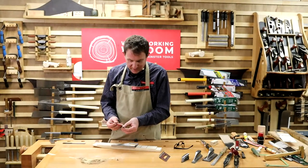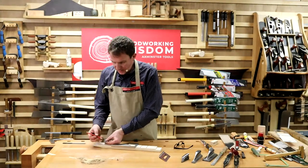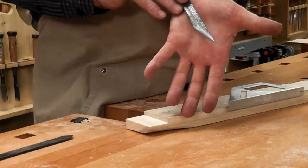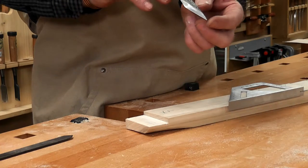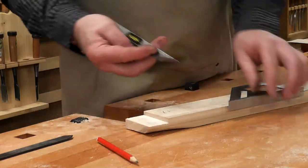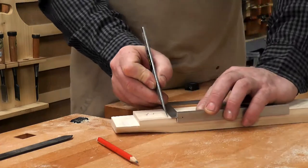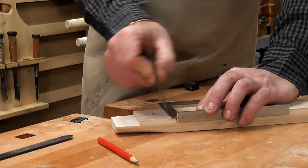This is good. Okay. They have a single bevel, which is obviously about giving it structural strength. So it comes up right to a point at the tip, right at the top here. All right. Ooh, that's close. So you get a nice long edge on there. This is actually right up to a point here, but it's only got one bevel. The back is dead flush, which means that anything I want to rest it on, if I line it up square, I get a nice 90 degree knife line this way.